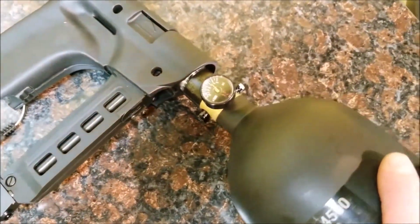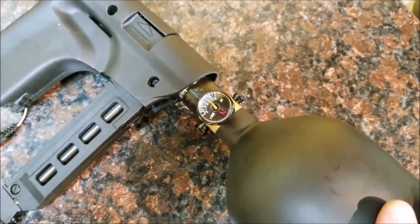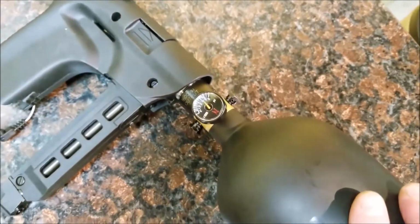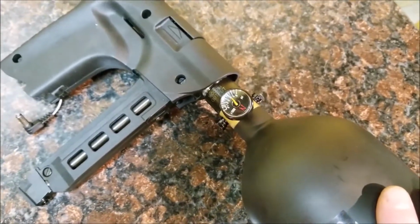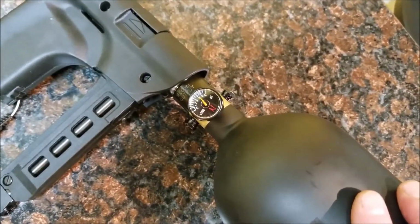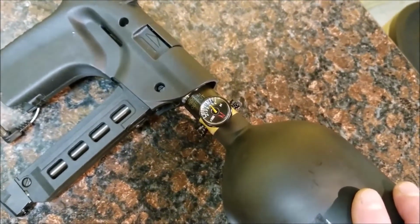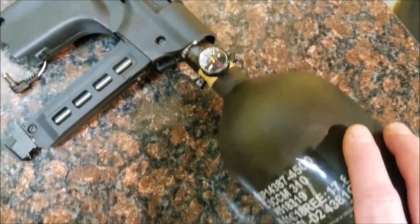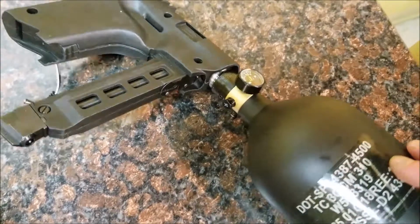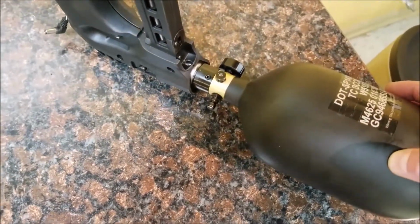At just about any pressure, because we like to run higher pressures than paintball, but they used to make the valves like paintball bottle regulator valves, and they stopped doing that, I guess because some guys were hooking them up to their markers and just blowing them up. They'll probably even build these up to 3000 psi, but that's not really good for what we want them for. Anyway, I don't recommend going over 1600 psi with this type of regulator.